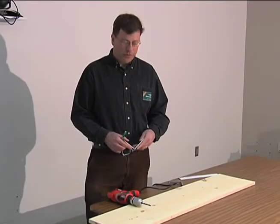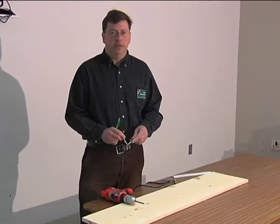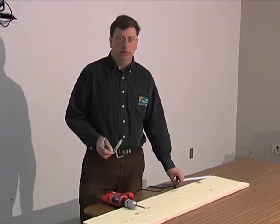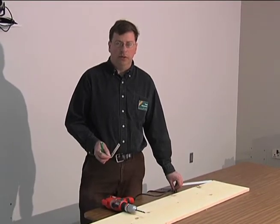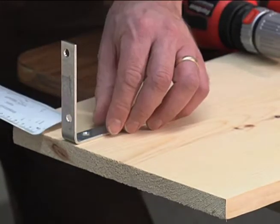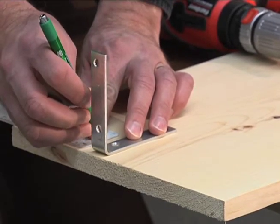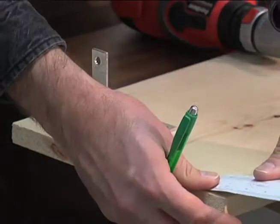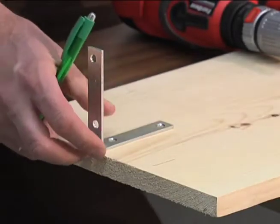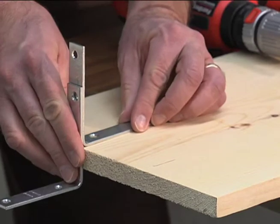We're ready to start drilling our boards. The brackets, like I said earlier, can be of different sizes. One thing to keep in mind is to have them uniformly spaced — it does the best job of making the bed look nice. It doesn't have to be exact, but it should be uniform. Take your ruler, measure the desired length — usually you want to divide it into thirds. You can do this just to kind of flush it up a little bit.